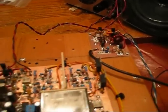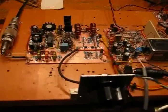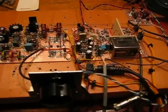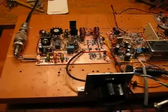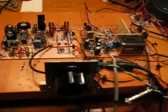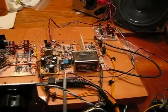So it's a very nice transceiver. With a little outboard amplifier right here, it can produce about 30 watts. At the 10-15 watt level, we've actually worked Spain on 20 meters here from our QTH near Seattle, and yesterday we worked Japan. It uses varactor tuning and we find this little pot here is quite touchy, so we're going to have to replace it with a 10-turn pot to slow down the tuning rate.